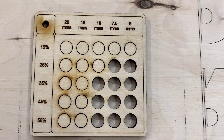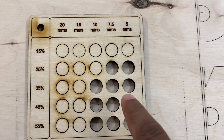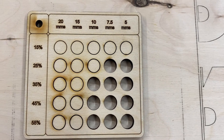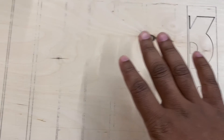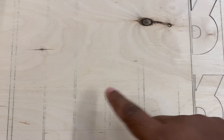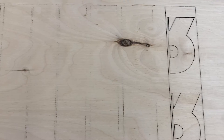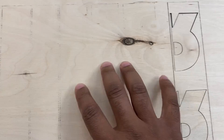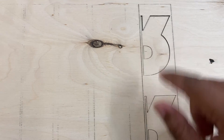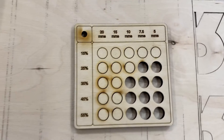As you can see, this is the test card I just cut — I have nice clean lines everywhere. I did go ahead and upgrade my air assist as well, so this is with the clean lens and the air assist upgrade, and that video is coming out right behind this one. This piece here is something I was trying to cut before I upgraded anything. As you can see, I have really faint lines where it tried to cut through, and this is after running it through a sander about eight times just to see any of these lines. So my lens was really dirty, causing really bad performance — not cutting anything — and I still have sections that won't pop out at all.